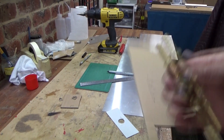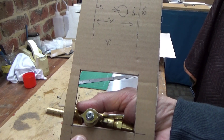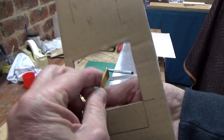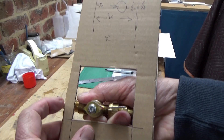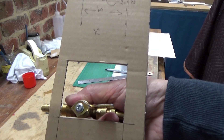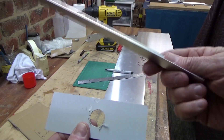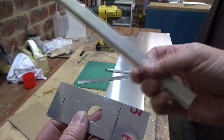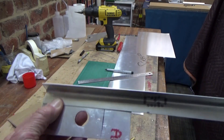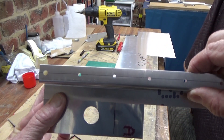Out with the cardboard again. If I get a box approximately that size with the tap mounted in there, then I can reach in and turn the tap off in an emergency or for maintenance. I'll put a little telltale like an anti-tamper lock wire, but we can finesse that later. I'm guessing I'll just use thin alloy, trusty old L-angles - put one L that way, then another on top giving me a nice flange. Do all four sides - we'll see how that works out.